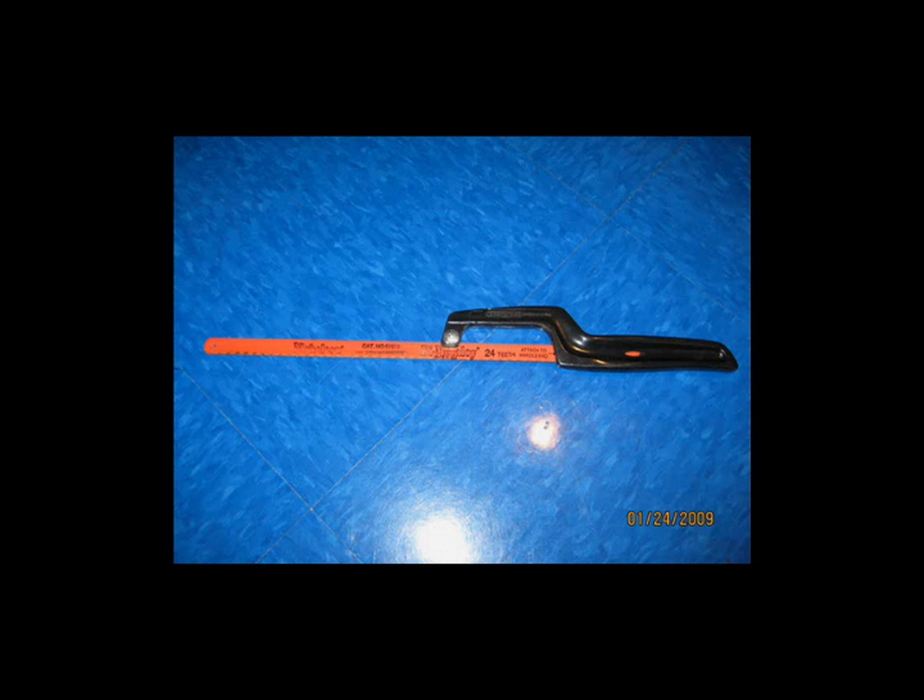But what happens is that leaves you with this very thin area toward the bottom of the piece of spruce cap strip. So the remedy to that is just to add another full-size piece of cap strip behind it and epoxy it together, and that reinforces that whole area to strengthen the notch.